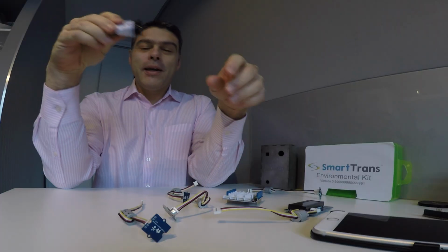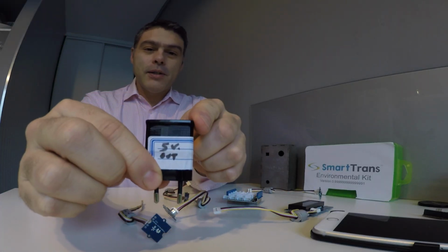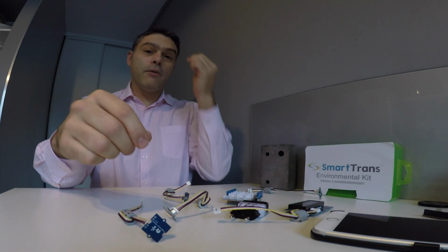The other thing we learned is that not all USB phone plugs are created equal. So when we're running in 5 volts, see now we have a nice 5 volt environment. We found that some of these plugs were 3 volts, some of these plugs were 5 volt. And that's another example. As you're going to be plugging electricity and power through the board, make sure you use the right setup.